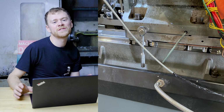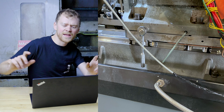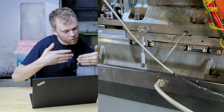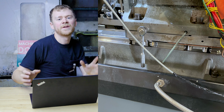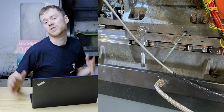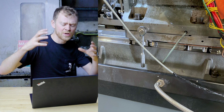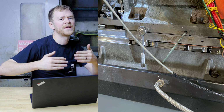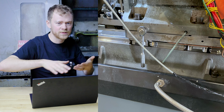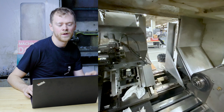it's so much easier if you have two Allen wrenches, or an Allen wrench and a ratchet, because then you can easily just turn them both the same amount, because you're trying to get them to line up but not go crooked, and you go around and around and around, and it's this process of you get a little better and you get a whole lot worse, and you start over, and you start over, and you eventually get it to where the sub spindle is concentric with the main. It is flat, it's not high, it's not low, it's not tilted down, up, or canted side to side. It's like a tailstock, just it spins. So think of it just like that, and you'll get it.